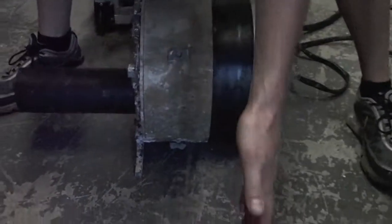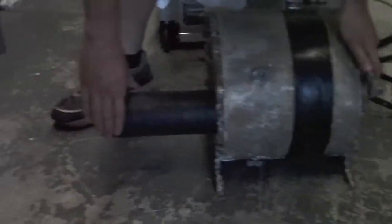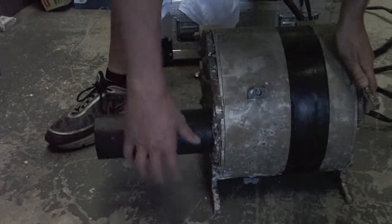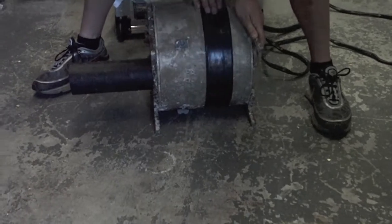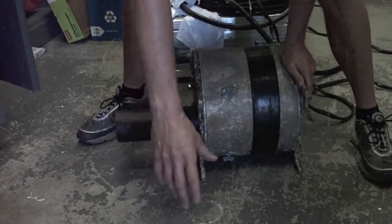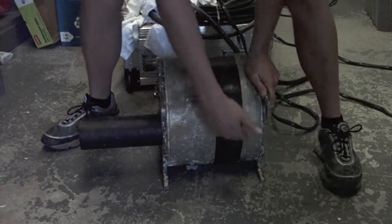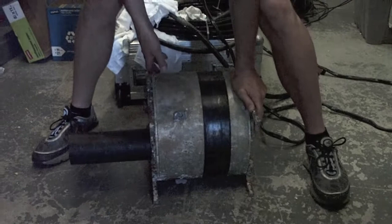This is the bottom — so this is what's facing the bottom of the ocean. This projector emits the sound pulse from here. It bounces off the ocean floor, and then this array here receives the pulse back. So you've got a transmitter and a receiver all in one unit. This will emit a pulse and then align it in a 150-degree swath from that one single ping.